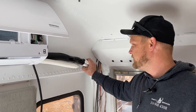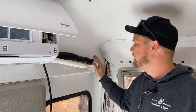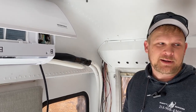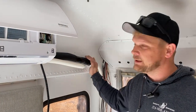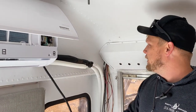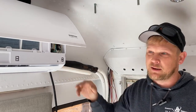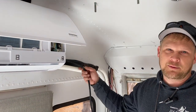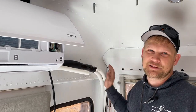Normally you would call this the liquid line and suction line. It's really the suction line and expansion line. Funny names. But since the part that normally splits up an indoor and outdoor unit is in the outdoor unit, both of these may frost over, so you have to make sure both lines are insulated all the way through. Then we ran our power line with it. Many splits get their power from the outdoor unit, not from the house or, in this case, the solar battery setup. So now we're running the electrical to it. Next, we'll be doing the drain. Then we'll be done inside and moving outside.